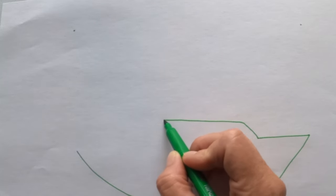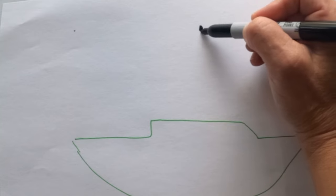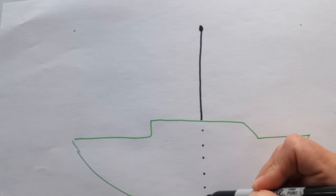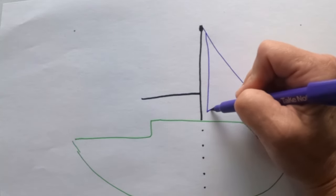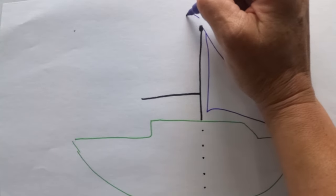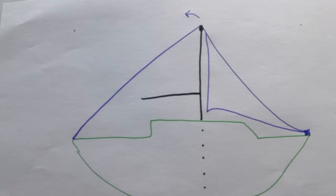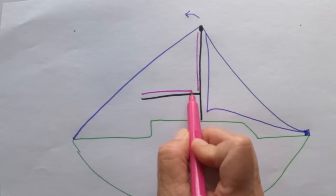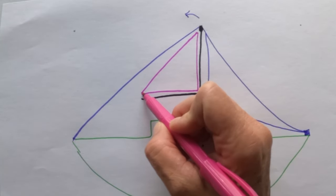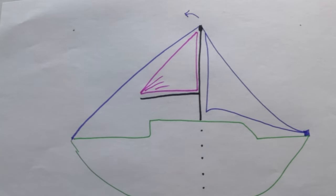We're going to do the backstay first because it has to go longer, and then we'll take a tape measure up there and measure the forestay. Wait — what is pre-bend and why does it matter to us? Let me draw Haraya. We have a keel-step mast, meaning it runs through the boat all the way to the keel. Our problem is our forestay is way too long, causing it to sag. This makes it difficult to furl in our jib. It also causes the masthead to bend back too far under the pressure of the backstay, causing the luff of our mainsail not to match the curve of the mast. This causes wrinkles from the clew, making the sail shape less efficient. So by shortening the forestay and lengthening the backstay, we solve both of these problems.